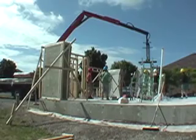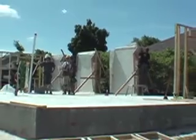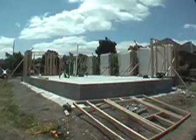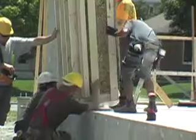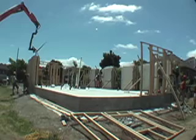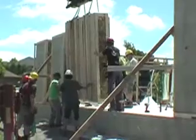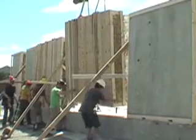As you can see, they go directly on the foundation. There are a few different ways of fastening them to the foundation, but they're all quite straightforward and simple. In this system we prefabricate the sections between door and window frames and will stick frame those door and window frames in afterwards. Once these walls are in place the building is ready to accept a roof. The panels are load bearing so there's very little time required once the walls are installed to proceed with construction.